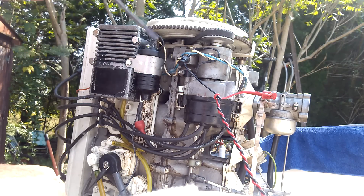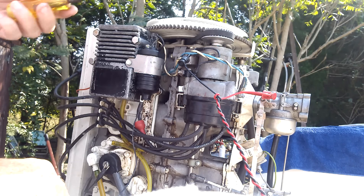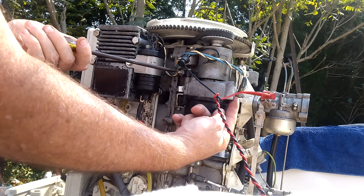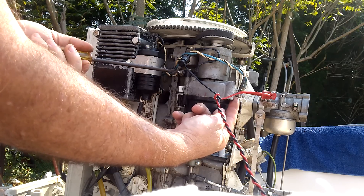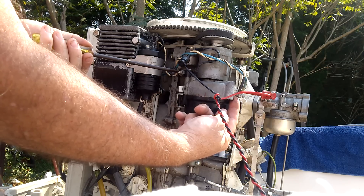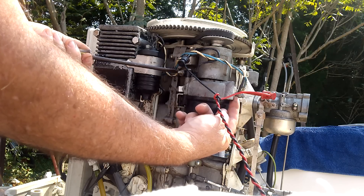These things don't drive into hard loads like a motorcycle or some kind of stock motor driving a pump or something like that. I'm going to put my finger here on the distributor and take the slack out of it slightly as I turn the adjustment screw, and I'm going to watch my meter — it goes to zero right there and comes back, and the spark plug would fire right when it goes low.